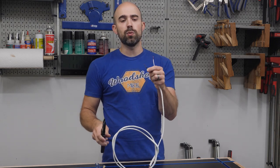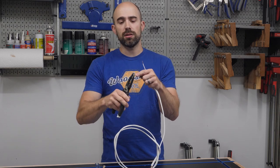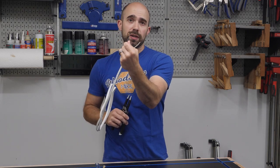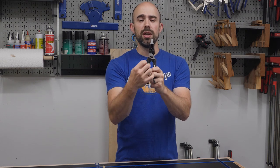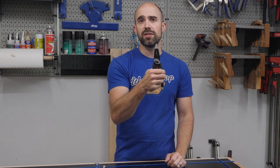If you need to wrap a wire around a lug on your outlet or switch, grab it about there and rotate it around — now you can hook it up. The last feature I like is a bolt cutter for 8-32 and 10-32 screws: thread your screw in until it's where you want it, close the pliers, and it'll break off that bolt where you need it.